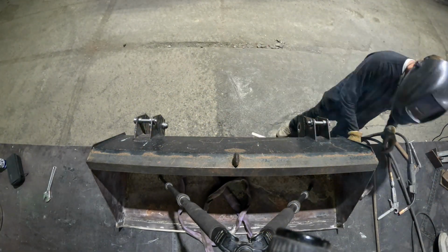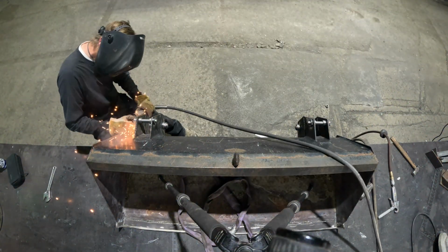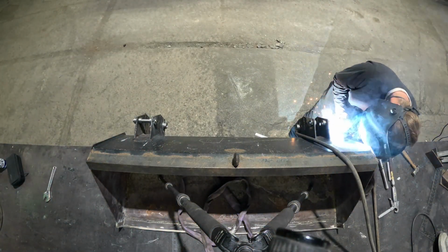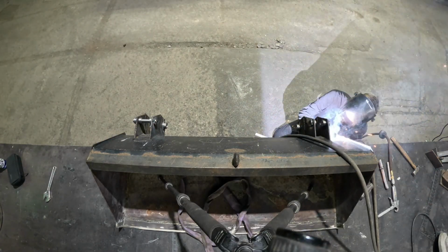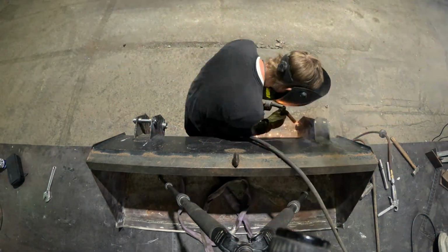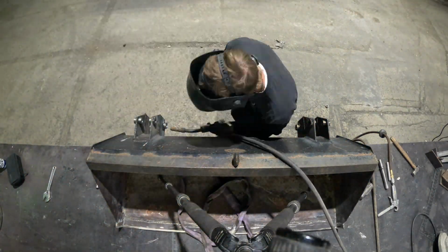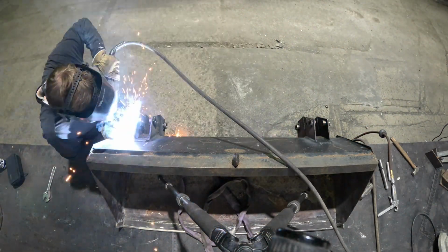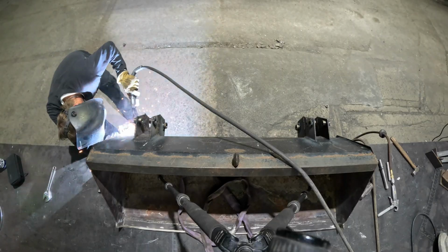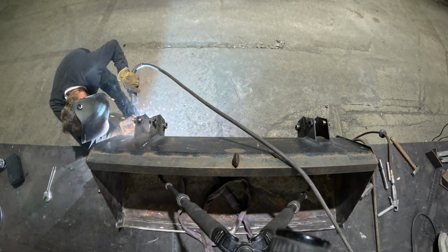So one thing that's different with these bushings is I put a flange on each one, and what that's meant to do is, whenever you have a bushing or something that has a shaft that goes through it, when you weld onto that, it shrinks. So in order to maintain some dimensional stability, if you machine a flange into it, it takes more material, you get less shrinkage on your part. So that should help. At least I don't have to deal with any stuck pins or anything, and it just maintains that straight. Also gives more area and more support for the bushing itself, transferring that load to the plate itself.